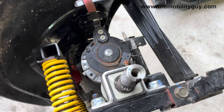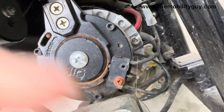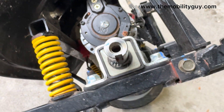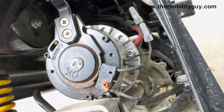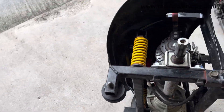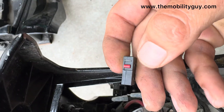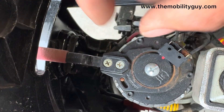So if you've got a mobility scooter that stops every time you go over a bump, most likely it's this micro switch. I think they're an SS5 micro switch — I'll put a link to them in the description. I'm going to take the switch off, take note of the pin configuration — it's the two outside ones, because some connect one outside and one middle. Then I'll solder on a new switch. There are different colors: red is a stronger one, black is the weakest, then white and orange — we're just going off the footprint.